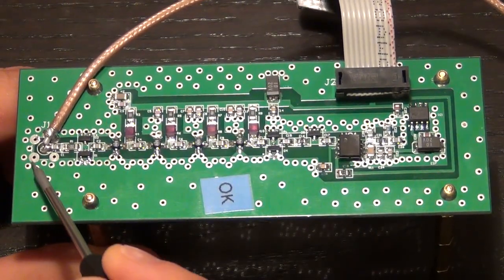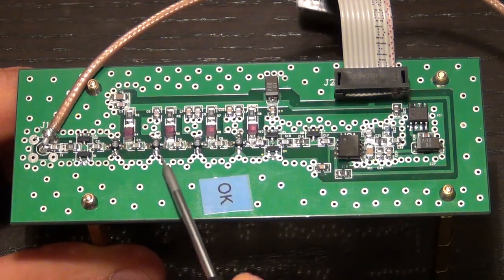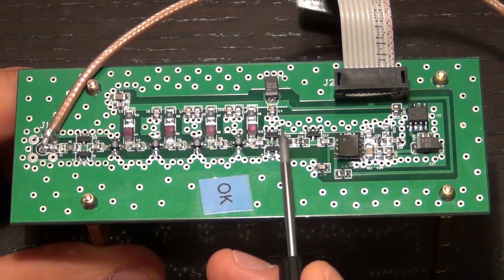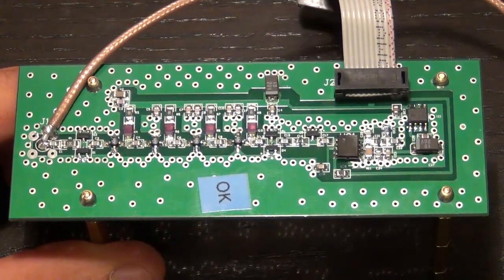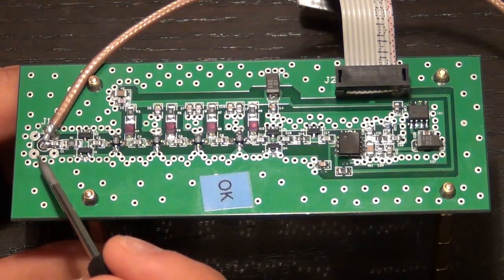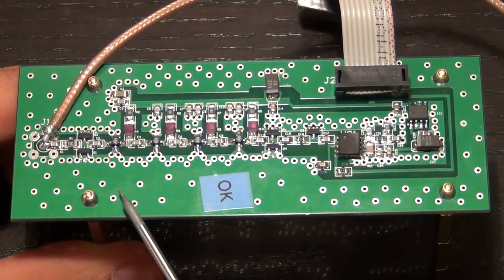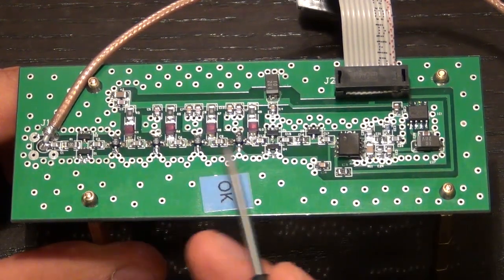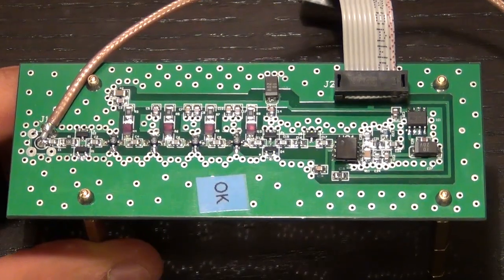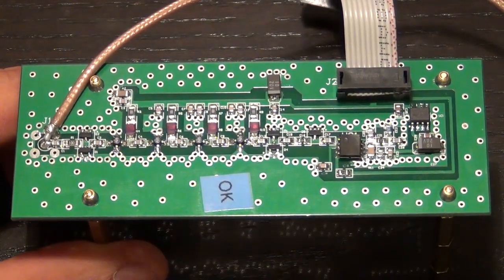And then once you get closer to the signal path here, you can see that there is a very careful via stitching around all the ground connections that surround all the high speed or the microwave lines. And that's also normal practice, because you want to make sure that not only you prevent signals from escaping, by creating a very good ground, but you also want to make sure that the impedance across this line is well behaved and constant.